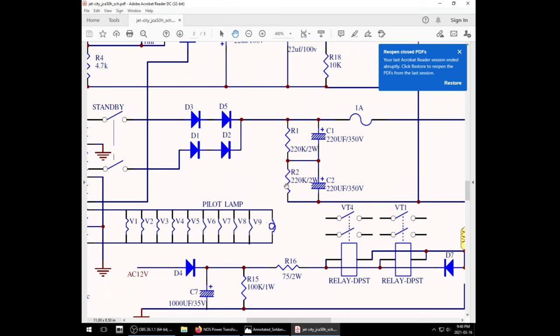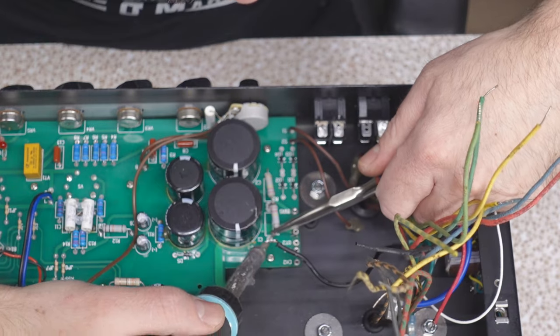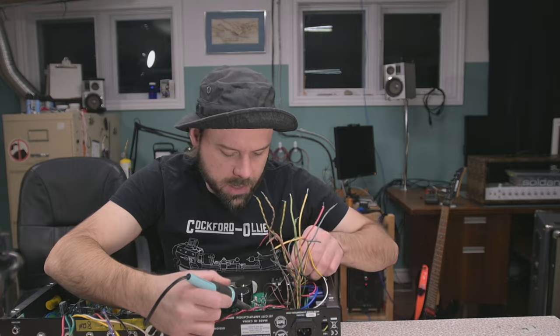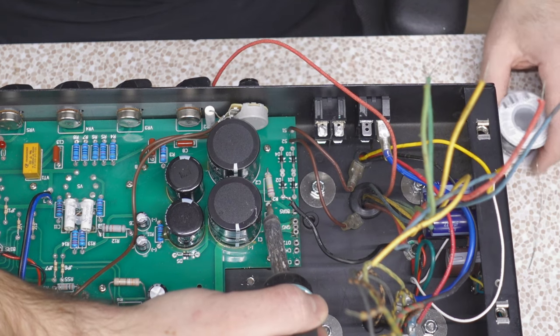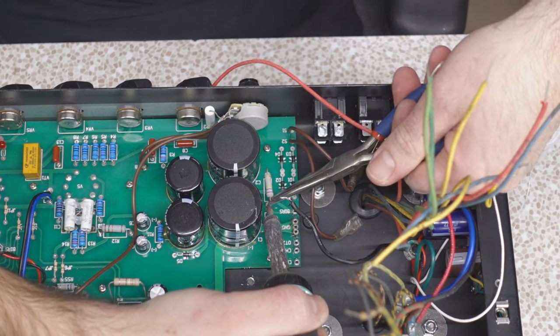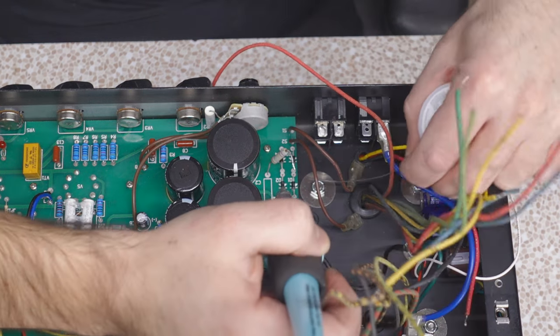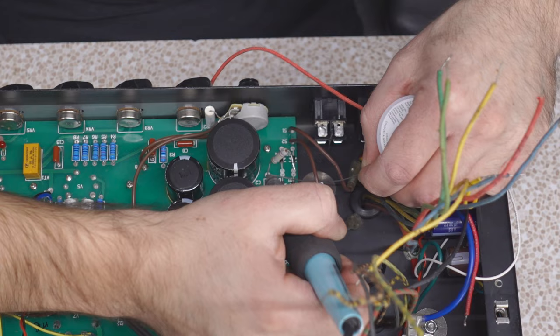We simply have to remove these two resistors and then connect the negative to the center here where the resistors intersected. And then, you know, we have to get creative with the diode arrangement. So let's get the resistors out. Just gonna need to coax them out with a dab of fresh solder. These resistors are for balancing an otherwise standard circuit, so we don't really need it for this application. And that's great because it gives us a hole to connect to.